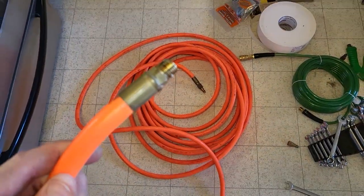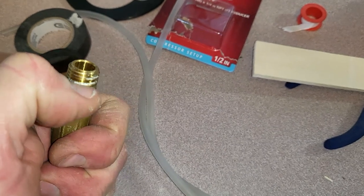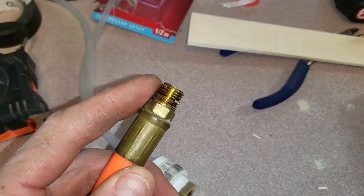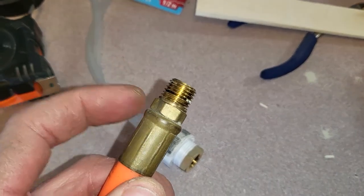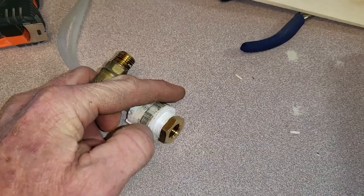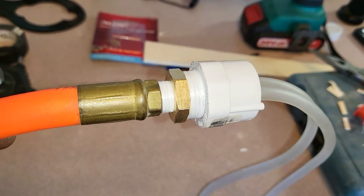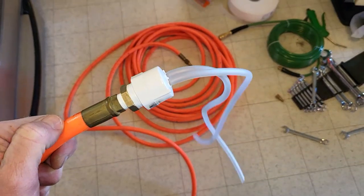I have my air compressor hose right here. I need to remove a little bit of the old Teflon tape on this one. For all your male connectors, wrap with fresh Teflon tape — remove the old and put on new — to keep your connections airtight. This threads into the quarter-inch side of the reducer. The half-inch was on top, quarter-inch on the bottom. And that is what the whip looks like connected to your hose.